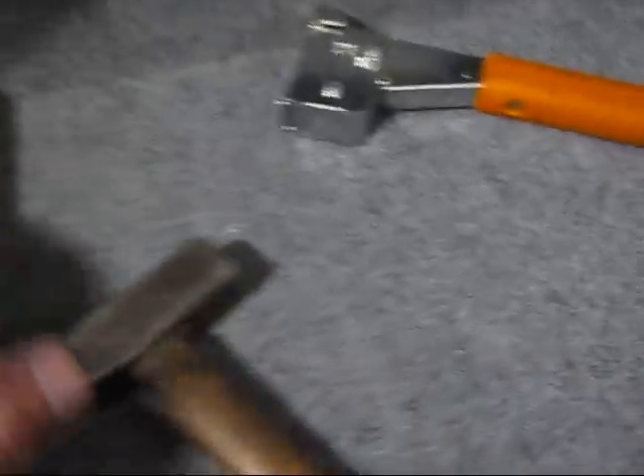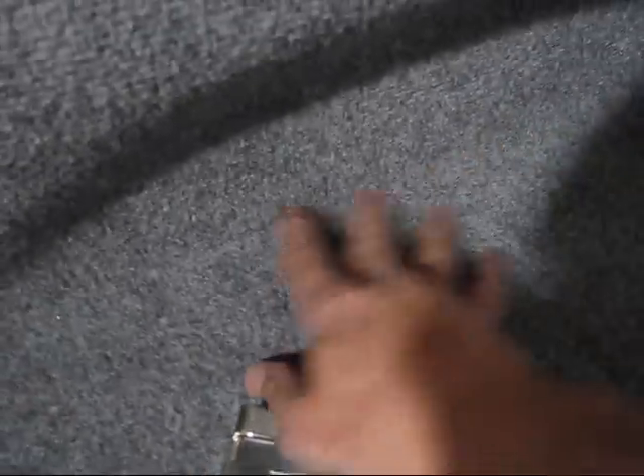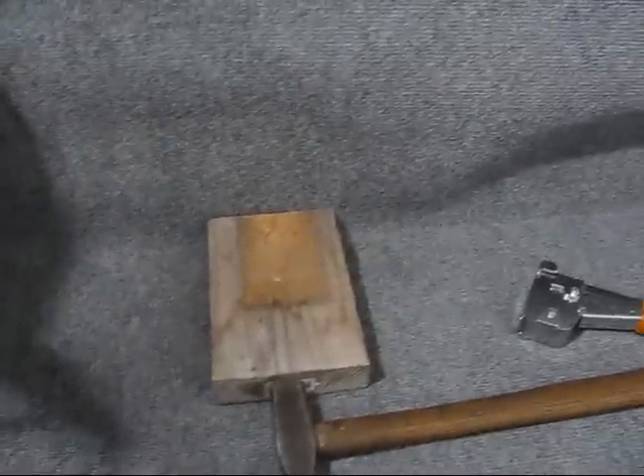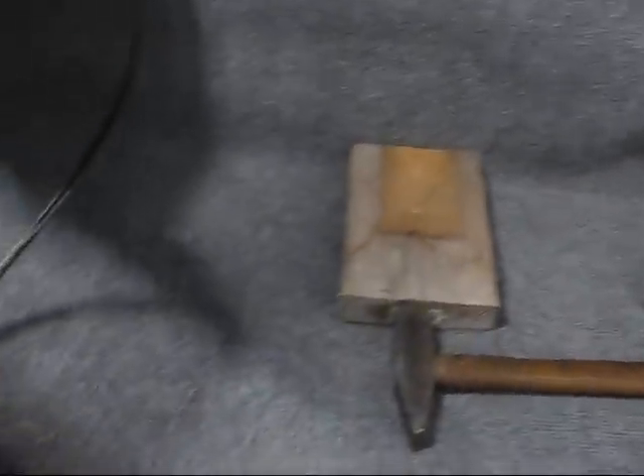I've got the base stapled here, it's getting pretty flat. I've worked my way up to the back edge of the box using just a scrap piece of wood. I'm placing it against the carpet and hitting it with the hammer to make this corner really nice and tight. And then right behind that 2x6, I'm hitting it with the stapler to keep that corner nice and tight — on the bottom and on the back — so that way it shouldn't peel back and it's going to look nice. I'm going to work on that all the way across, and that should help keep everything square. Then afterwards I'm going to trim everything and tack it all on the sides. Those are shadows, not wrinkles.